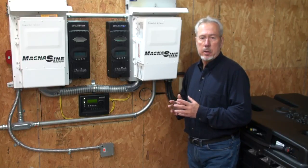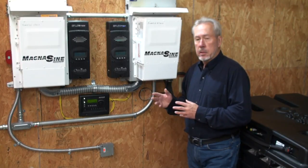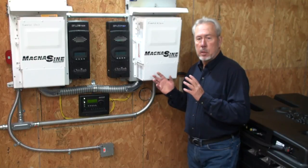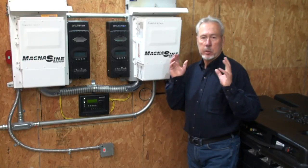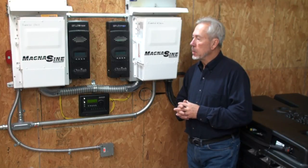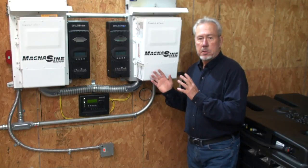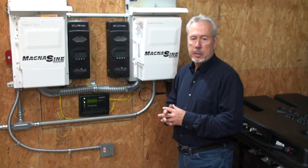During the winter that's not near enough power coming in when you have all these overcast days. So this actually has a hybrid system that's grid-available. There's no connection like a grid tie — no connection between the solar and the grid. However, it has a transfer switch set up which can be switched completely on the grid or completely on solar, one way or the other, and it's manually operated. That gives them the ability to keep everything going — their freezers and everything on solar — but still use the grid if they feel the need to, and during the winter they generally do. Adding more batteries will probably be the next option.